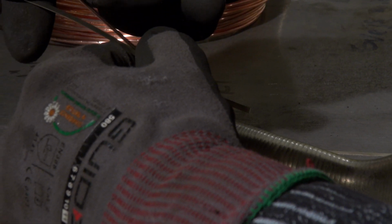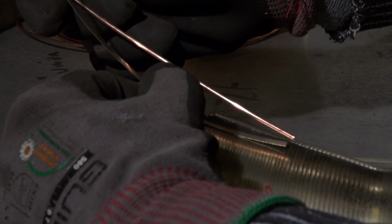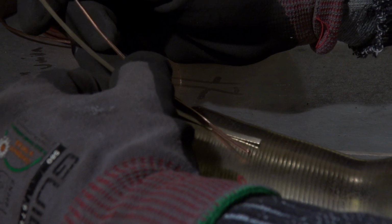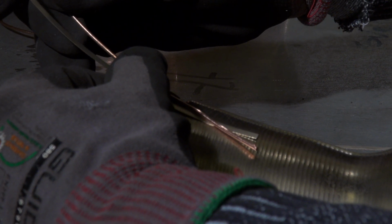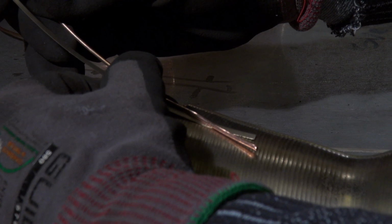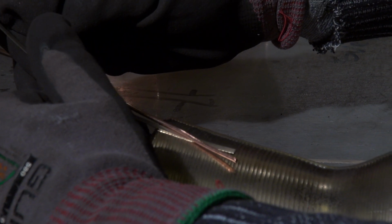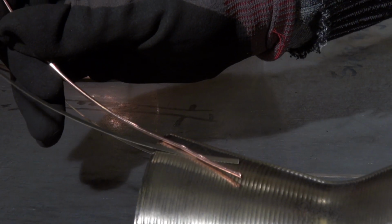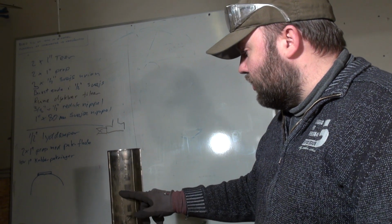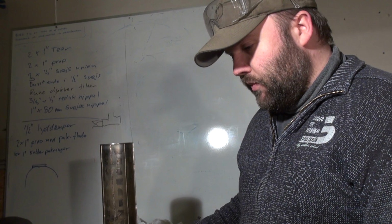But the basic idea is to sandwich the silver solder material in between the copper spacer and the liner. In this way, when you put the whole thing into the ceramics oven with the inert atmosphere, the silver solder material will melt underneath the entire copper wire in the full length and give a very efficient mechanical and thermally conductive adhesion between the two.